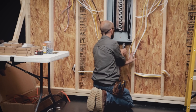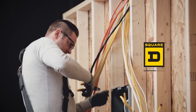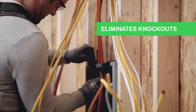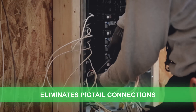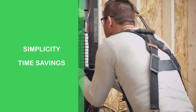And our hunch was right. Typical rough-ins cause frustration during installation, but not with Square D. The Quick Grip wire management system makes rough-ins simple and nearly eliminates all knockouts as well as the required connectors. We've also eliminated the need for any pigtail connections during trim-out by turning the mechanical connection jaw of the breaker into an electrical neutral connection jaw that plugs directly onto a distributed neutral bar.